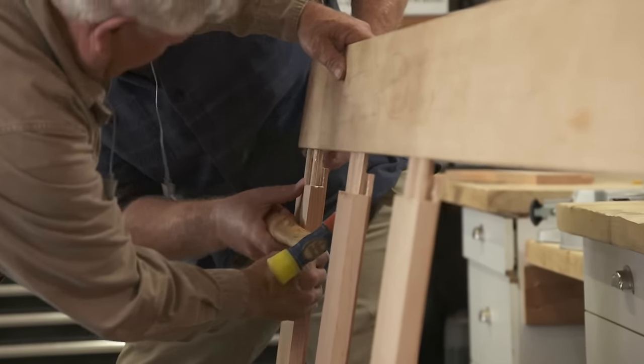Okay, that's all we need. Now we're ready to put the screen in. The first thing we need to do to get the screen in is put the door under tension. Tension because? Well, I actually want to make the door, think of it like a bow and arrow, how the bow has a curve and the arrow, the line is straight. So that's what we want to do with the door. We want to make a bow out of it, so we're going to bend it down.